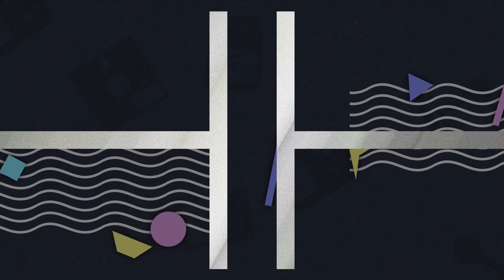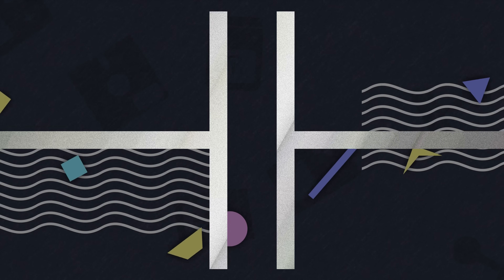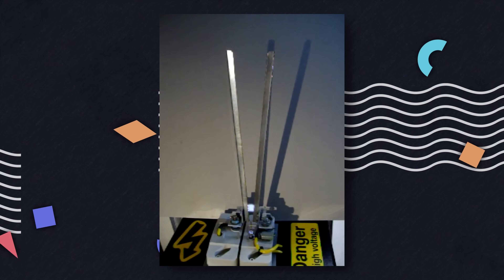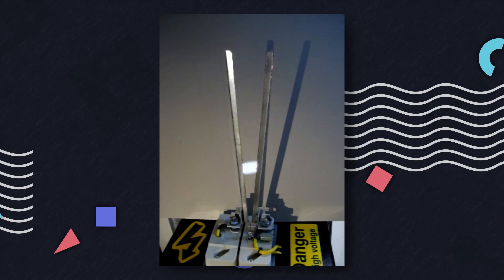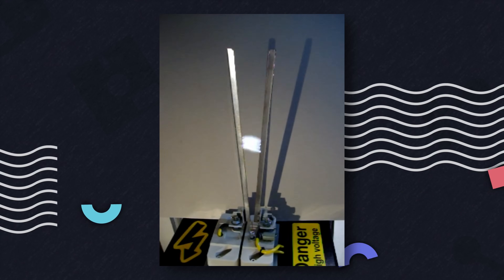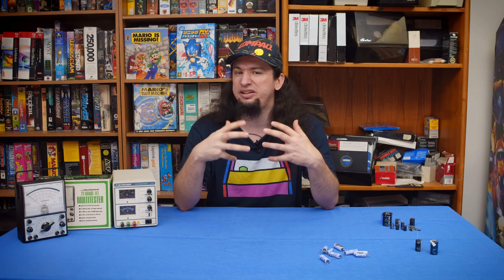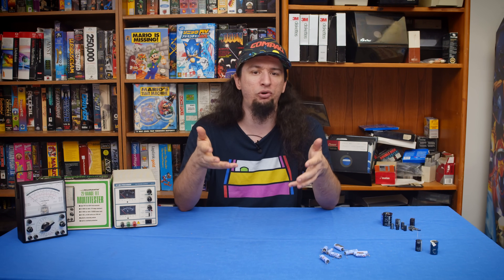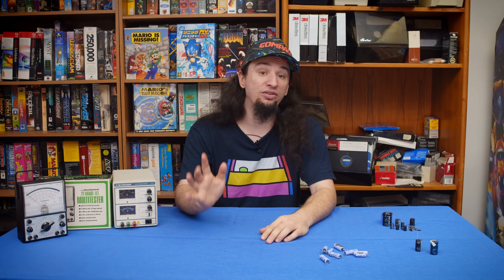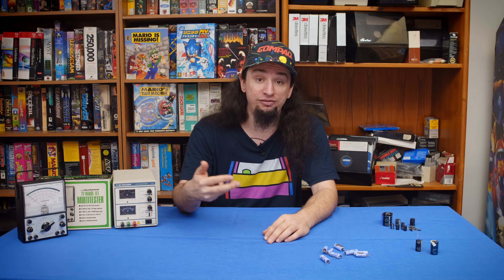The breakdown voltage is a known voltage limit that the insulator can prevent the flow of electricity up to. If a voltage higher than the breakdown voltage for the thickness of the insulator is applied, an arc will form between the two conductors. This can be seen in examples like a Jacob's Ladder, where air is the insulator and with a high enough voltage, an arc will form. Due to the breakdown voltage requiring sufficient insulator thickness, you have a limit on how close you can make the conductors, making surface area the primary means to set the capacitance value.